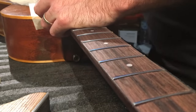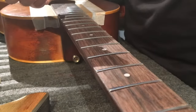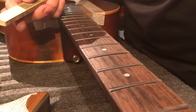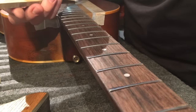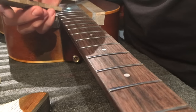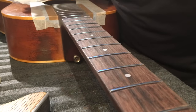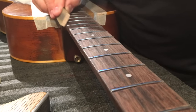What I have is a little piece of maple, nice and flat. I've put a piece of 320 grit on one side and a piece of 800 grit on the other. Obviously they are nice and worn. What I do is I use this just to get rid of file marks and chatter, make them nice and smooth. I don't put the paper right to the edge — I leave that until about a millimeter — I can just run it sliding against the tape, doesn't cut in.